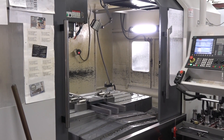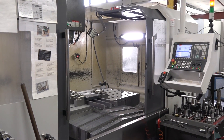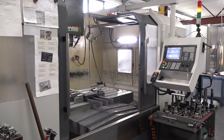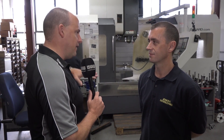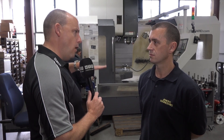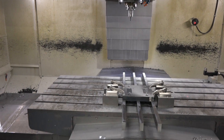So we were looking for something with a bigger work envelope so we could do more machining in the Y, and also with more power. This has got that — a very large working envelope for a machine of this footprint and size. Coming into the building, it must be quite hard to get machine tools in here. But it's got that upside-down Y axis, which means you're able to get a bigger working envelope inside the machine.